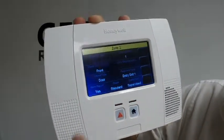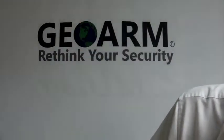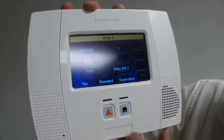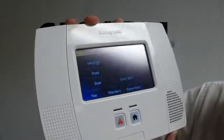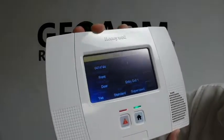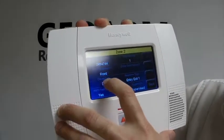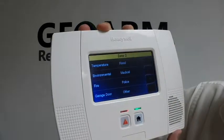Select Edit. From here, you're going to put your serial number in. After you have your serial number in, hit Done. Now you have to set this up to the right loop number. As mentioned, this is a multi-functional device, so you have to look in your directions to see exactly what loop number to set it up as. We're going to leave it as loop one, because that's what we're using it for. For Device Type, this is going to be an environmental sensor — arrow down to Environmental.